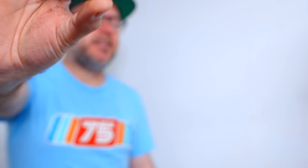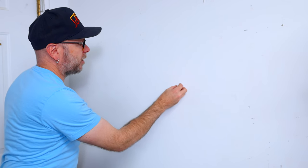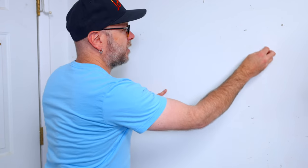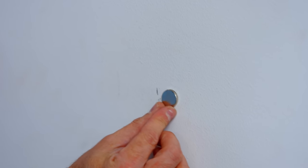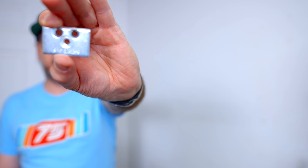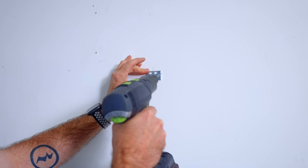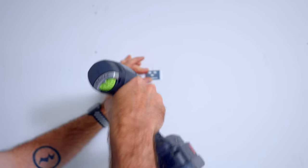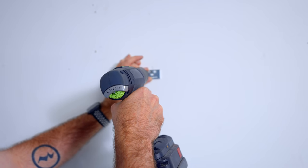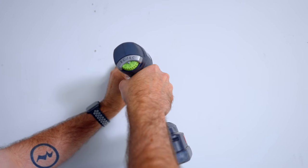First thing I'm going to do is take a magnet to help me find the studs — it should just stick to the drywall screw. Boom, right there. We got one, and then 16 inches over it should find another. For this particular brand you want it so it looks like a face — the two holes at the top are where we'll put our screws so it attaches to the stud. For now, we're only going to pilot drill one hole and lightly screw it into place until we get the second one up there, so that's going to go about right there.